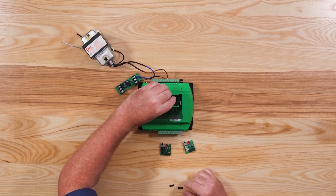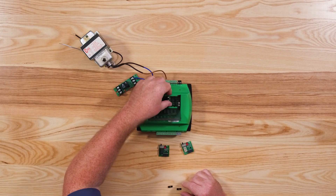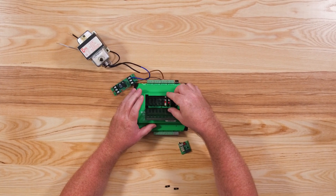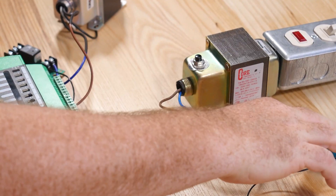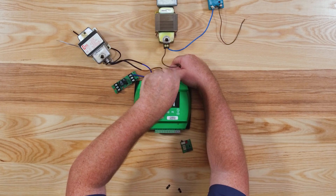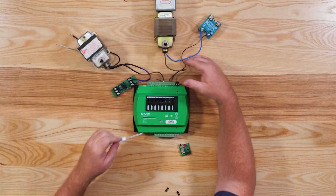Now let's look at the HPO 6703 normally open relay board. The process is very similar, however there are a few differences. Remove the jumper and insert the card into the appropriate slot — in this case, the seventh slot which corresponds to universal output 7. Because this is a mechanical relay card, we can power the switch common up to 30 volts AC or DC with a 2 amp maximum load. Remember, the triac card could only take 24 volts AC, so this is an important distinction. From the appropriate transformer, take the phase wire and connect it to the SC port to supply your voltage, then wire the output properly to complete the circuit.